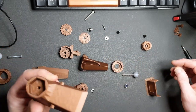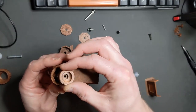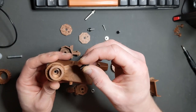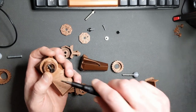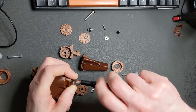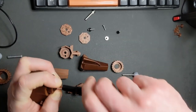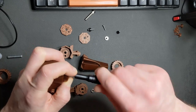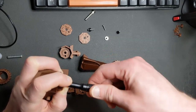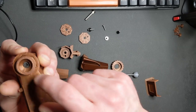We'll start off with the foot. The foot has this hole in the middle of it, and that's for this little housing here to sit into. You tighten that up with an M4 bolt. When you first tighten it up it should need to be threaded, so it takes a little bit of effort — just keep clamping it together, keep screwing it in. Once that's done, the head of the bolt should sit lower than the socket, so that the ball when it's spinning in there isn't going to be impacted by it.